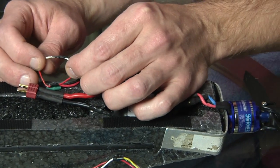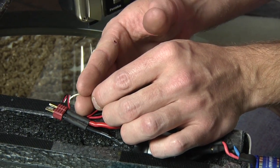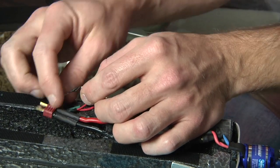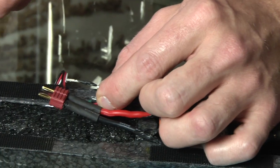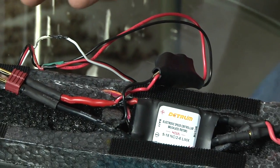When you're installing an on-screen display, all you do is cut this wire, run the camera into one side, and the video transmitter out. All it does is take a splice and go through a heads-up display. In this case, I didn't want one.